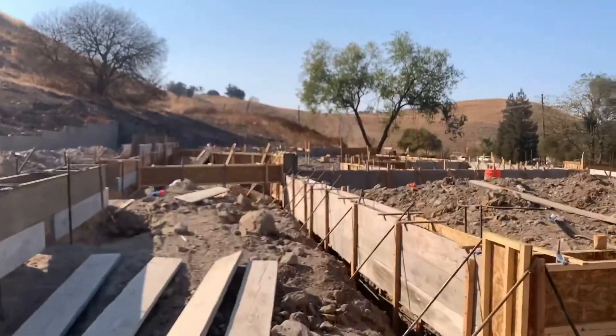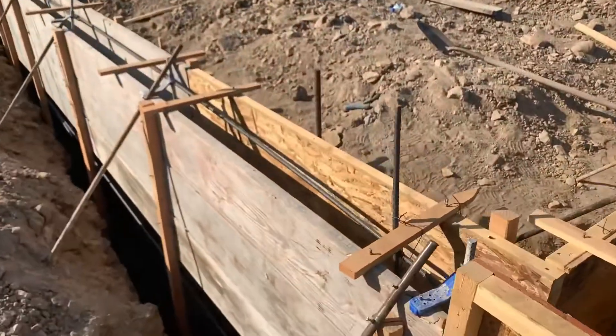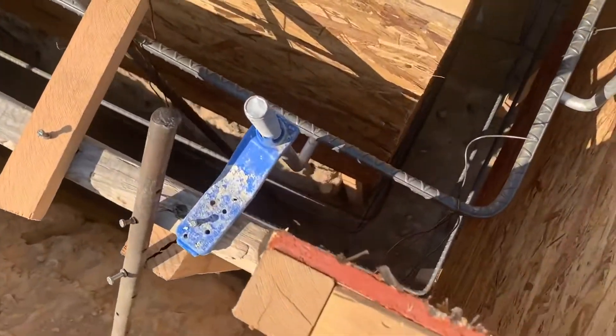This is where the ufer ground is going to go. The ufer ground is a piece of rebar that sticks up through the foundation and goes down into the footing, then runs the length of the footing tied onto the rest of the rebar. Where the ufer ground is, that's also where our electrical panel is going to be. I'll have to stub in two or three inches of conduit — they come up from underground, go through the footing, then up through the stem wall and pop out near the ufer ground so I can run power in from underground to the panel.